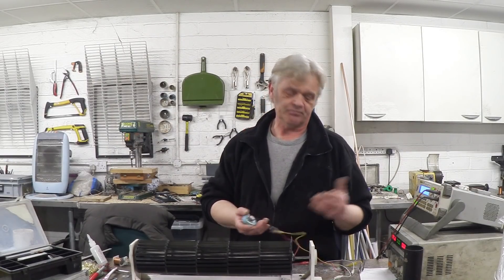We can actually get a couple of volts out of that. Now this isn't strictly switch reluctance, because we're just passing the steel in front of the magnetic field — what it's doing is redirecting the flux a little bit as opposed to switching the flux. But it still gives us a result. We did get 20 volts with the previous setup and were able to light up that bank of LEDs; with this we'd be lucky to light a single LED.